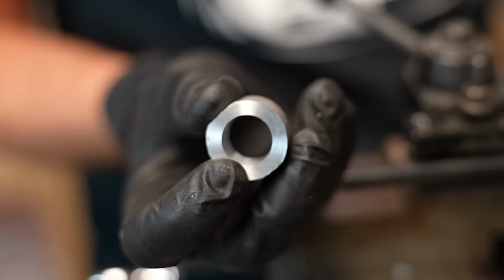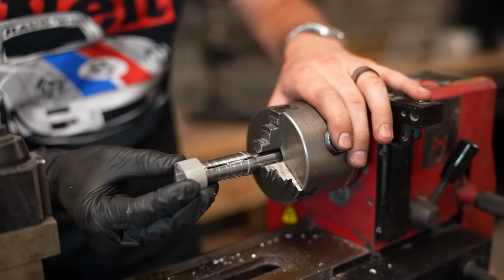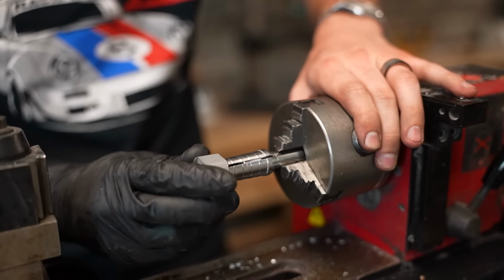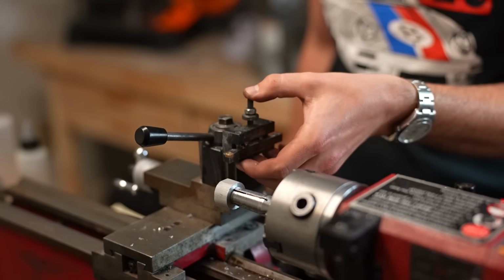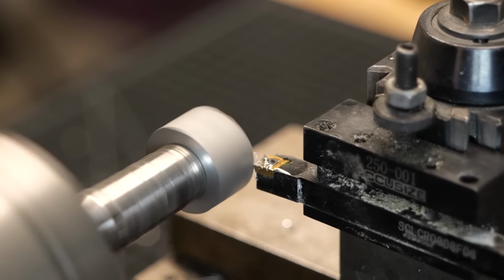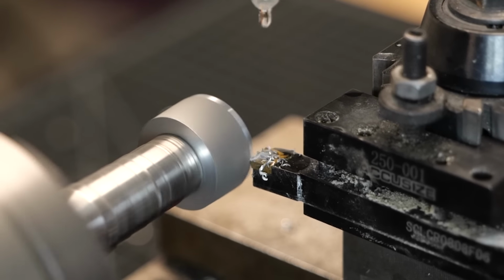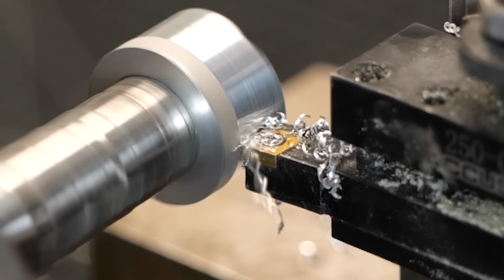All right, we've got the inside of the ring blank looking nice, but I can't say the same about the outside. This looks like a third grader's craft project gone horribly wrong, so we need to change that. We're gonna whip out the Patrick Adair Supplies expanding ring mandrel. We're going to attach the blank to that, and using a tungsten carbide cutting bit, we'll go ahead and slowly trim down that outer diameter.